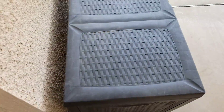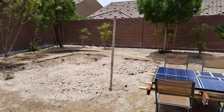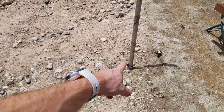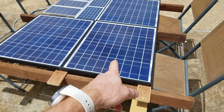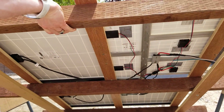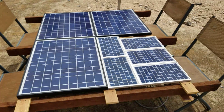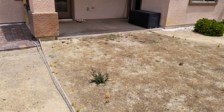Here's the wire coming from outside. I'll show you — the cable runs around the side and comes out here to my solar panel. I was actually going to put it on a pole — there's an old dirt hole we need to fill in, used to be a trampoline here. But here are the solar panels. I believe these are 45 watt, 22.2 volt output cells, and I basically just wired up the back and put one of those Anderson connectors out here.